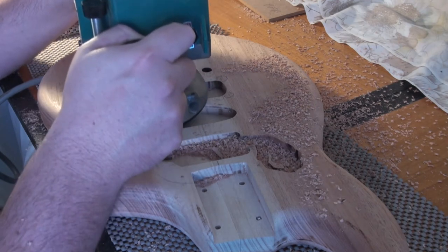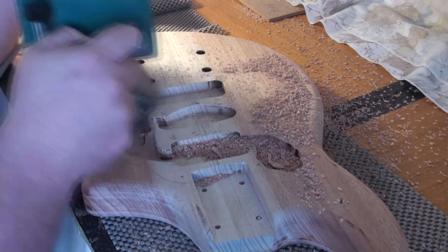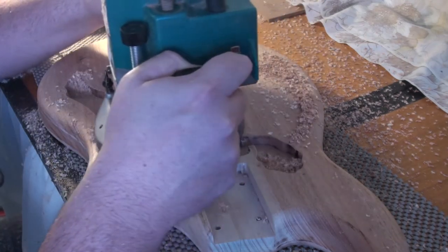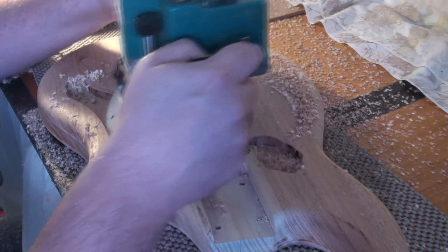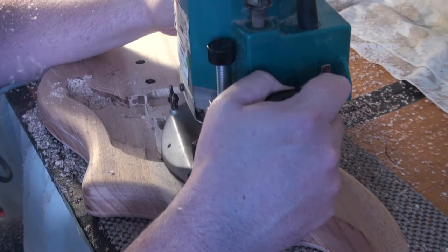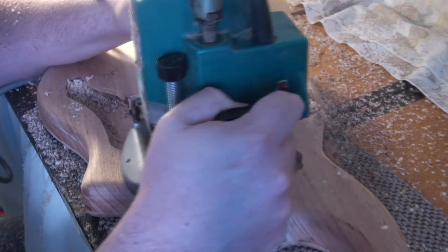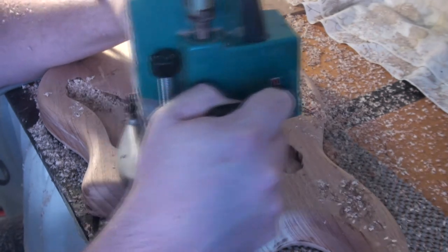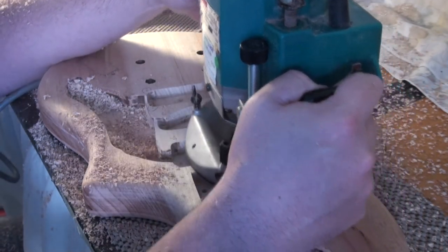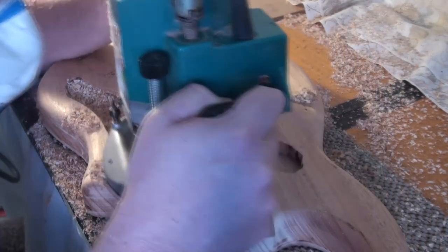When I had to wire up a second pickguard for the original flamingo practice build I made first, I changed the wiring to a standard strat configuration including a switch because this wiring simply did not work effectively on that one. Lately I've been thinking back on why the 4 volume 1 tone wiring did not work when it did on the first harness. I think I made one crucial mistake when replicating it, but in the end it could have been because of all the crappy pots I was using.